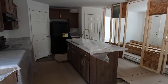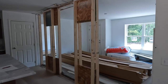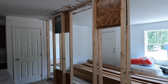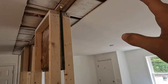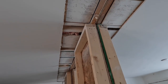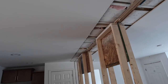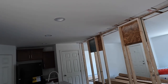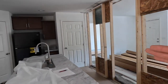So we're standing inside the kitchen, dining room, kind of living room space. These walls here are temporary walls that are used to support this load-bearing joint on the house. This is where the two modules come together — you can see it very clearly here: one module this way and one module this way. On the load-bearing wall, you have these support pieces so that it can brace this from a shipping standpoint. But there's nothing structurally standing between this living room and kitchen space, giving you this nice open floor plan.